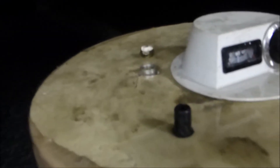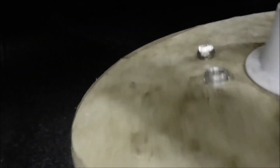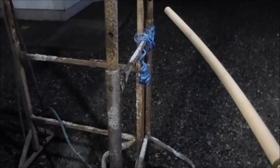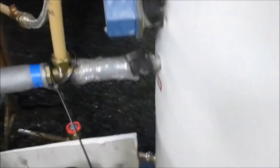The hot water storage tank — you can see that hole here — is open into the tank, and this pipe here is also open. Follow it out: it's open vented. So it wasn't allowed to build up pressure, but just the same, it made a big mess.